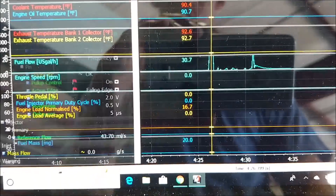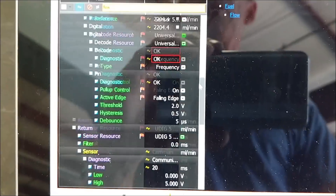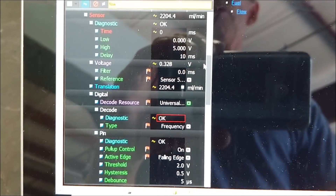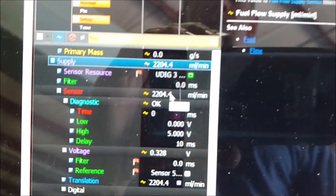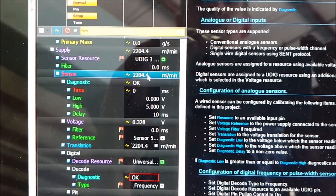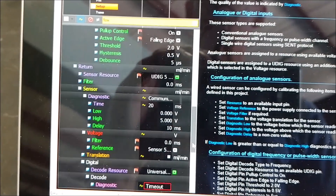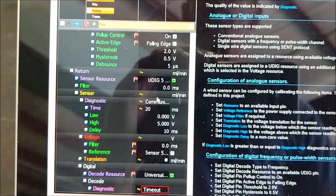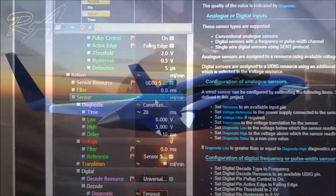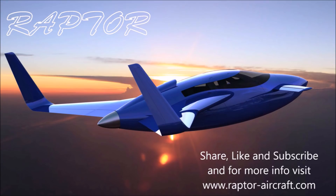Once that reducer comes for the oil return line for the turbo, I'll be able to run the engine. The goal is to run it up to 3,800 RPM — we should be able to get there with this new pulley ratio. With the accurate fuel flow from both the feed and return sensors, I should know exactly how much horsepower we're putting out at that setting, and we'll be able to extrapolate a lot of information from that. We've got the Fourth of July, so no one's working tomorrow or Wednesday — but that's the update for the first half of this week. Thanks for watching.